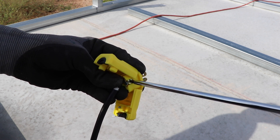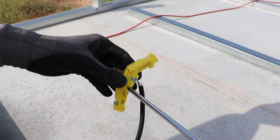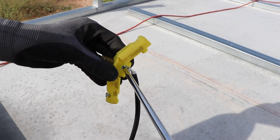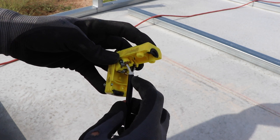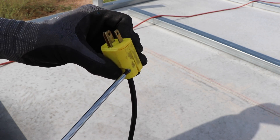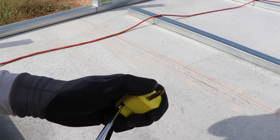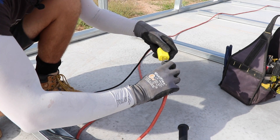Then all we have to do is tighten down each side — it's a clamp, so it'll get nice and tight. Come to the other side and tighten that down as well. Then we take the outer screws and tighten those down to clamp onto the cable itself. And there we go — we've got a new end on our power tool. Let's plug it in.